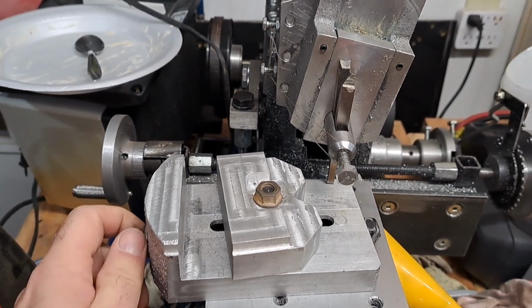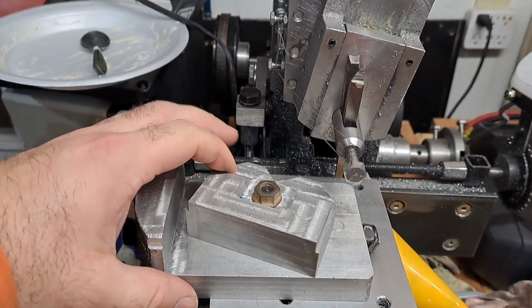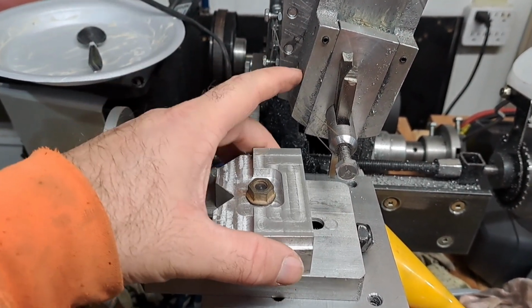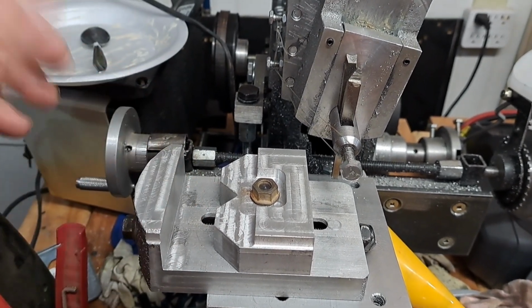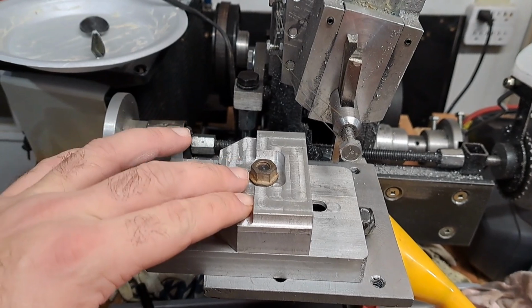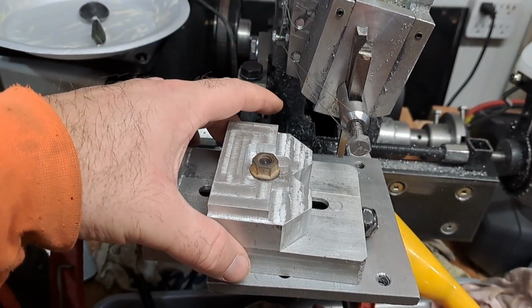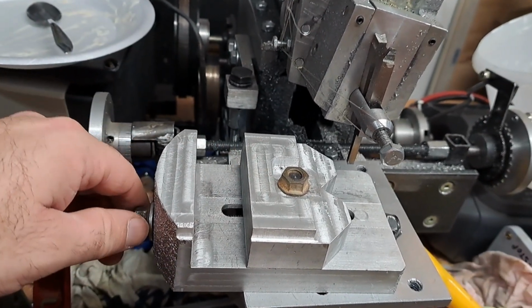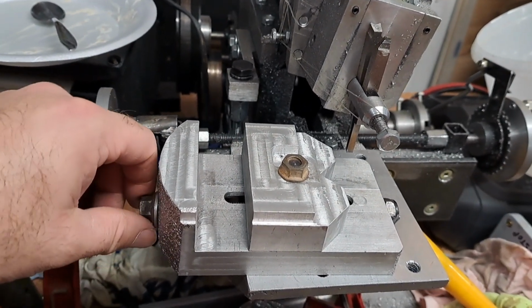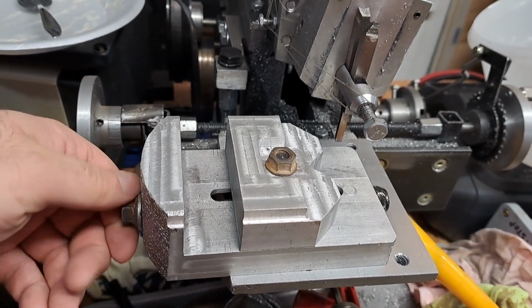And it's just the perfect size for the shaper. Gives me about 2.5 inches of clearance to put something in there. The jaw turns around. There you could hold round stock. I mean, works for me. Still gonna make a couple steel jaws for it to put on the inside and outside. I'll make them out of 1/8 flat steel. But she works really, really good.